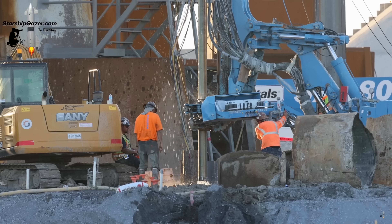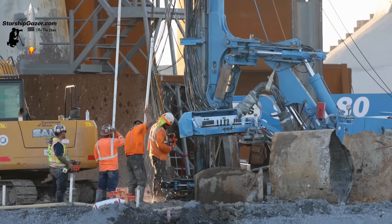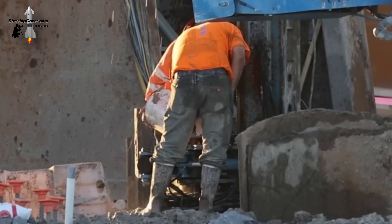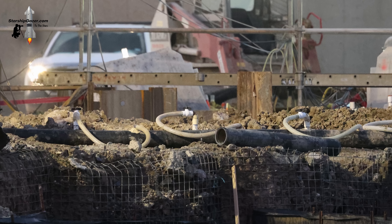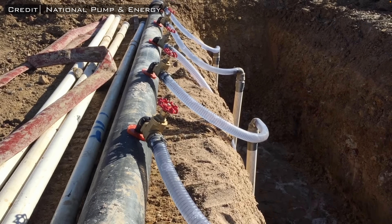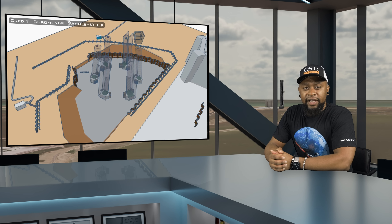This is similar to what you would use for a core sample, except there is a water jet in the center of the pipe that displaces all of the sand and soil as it's being cut away, creating a water-filled hole in the ground. After this, a riser or well-point — essentially a PVC pipe with a small opening on one end — is lowered into the hole. Then a filler material is added between the pipe and the wellbore, which holds the pipe in place and also acts as a filter. Shout out to StarshipGazer for capturing this footage. Once the network of well-points are installed, they are connected to a larger pipe manifold using collection hoses. This manifold is connected to an external pump which is used to pull a partial vacuum on the tubes. The suction force will extract the water from out of the ground while leaving the sand in place, temporarily lowering the water table several meters below its natural depth.